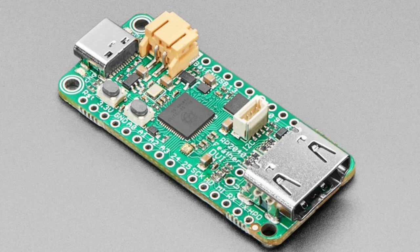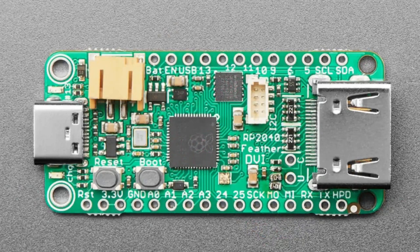It's all-in-one — you get all the Feather pins labeled at the top with standard Feather GPIO, I2C, 8MB of flash, USB-C, and the DVI output at the HDMI port using eight consecutive pins. You also get hot plug detect, CEC pins, and I2C from the DVI for EDID reading so you can tell what monitor is connected. It will be coming soon — sign up, because they'll go fast in a week or two.